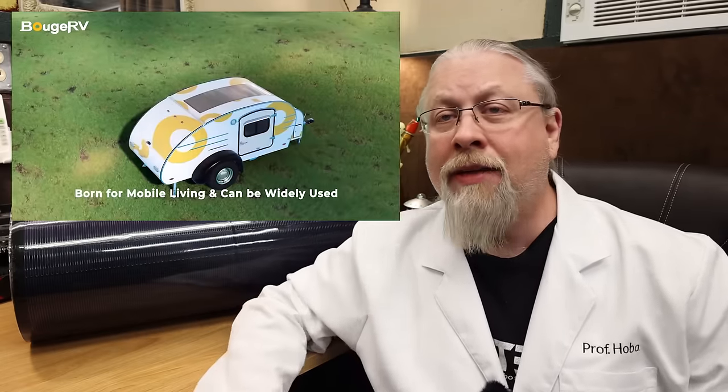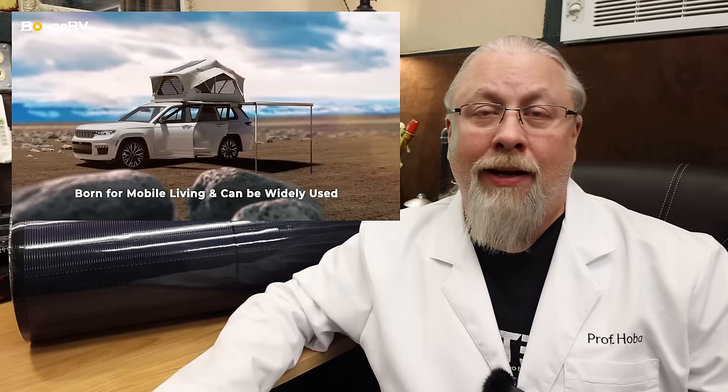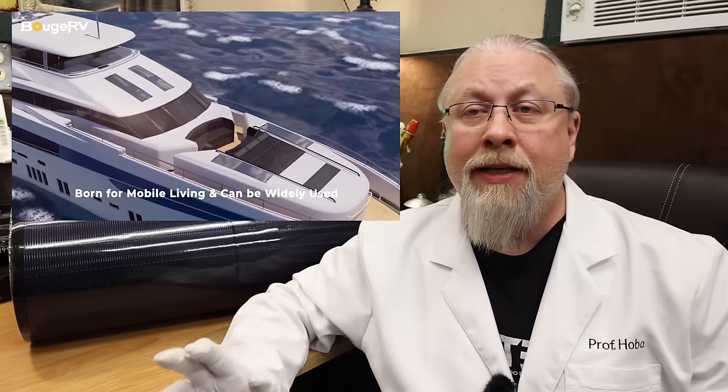If you live in the Pacific Northwest, camp often under trees, or at higher latitudes, you'll find the CIGS is worth every penny. CIGS tech just isn't cheap, and neither is the Yuma. While a typical mono glass panel might cost 80 cents per watt, the Yuma is going to run almost three times that, and the price is what scares off most folks. But once you realize how durable this technology is, how much better it works in partial shade — which occurs on virtually every RV and van roof — and how much easier and non-invasive it is to install, it's well worth the investment, especially for a low-profile install where you don't want to worry about shading, damaging your panels, or losing fuel efficiency.